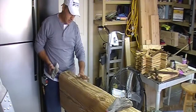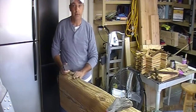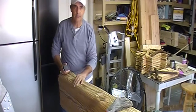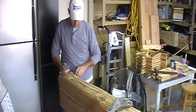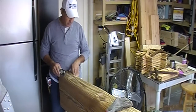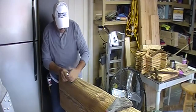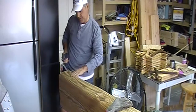I cut the four plugs off and they match okay — it's not a great match, but we did everything we could to match the grain. You'll be able to see them from somewhere in the church if you're looking, but we did the best we could. Some of the grain doesn't work out perfectly, but that's okay. I'll plane this level and come in with a wire brush to brush it out. Sometimes it's a matter of knowing your circumstances and doing the best with what you have.